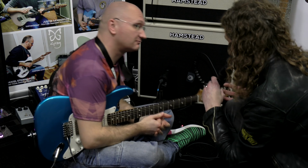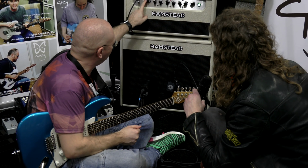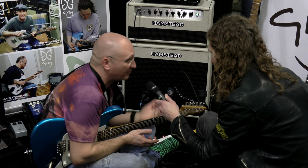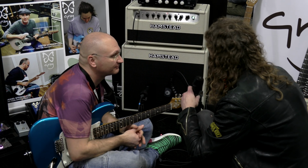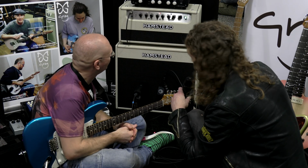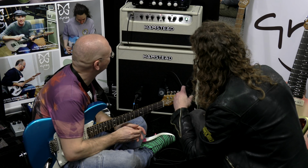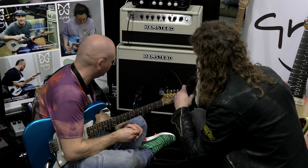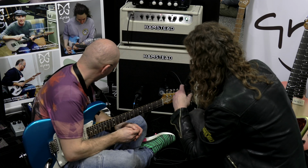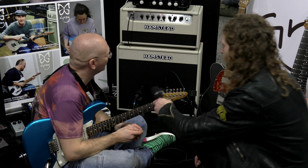It's classic rock, heavy blues, doesn't get into metal territory. But obviously, it's a good pedal platform, I would assume. Yeah, the 60 especially is really designed for headroom. The output transformer could do 120 watts, so it's crazy overspec'd. You've got a super clean output section, and then you can crank it up if you like. It works really well for pedals, keeping really clean.